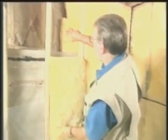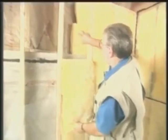Now that we have some of the insulation installed, let me show you what's taking place. First of all, the vapor seal that we originally put on the concrete has gone back down in behind the stud wall and wrapped around and come back up over the insulation that we've installed in between the studs. Now in behind, what we've done, we've laid batts on their side on top of the concrete wall up against the wood structured pony wall. And as you can see, the old insulation that was there already, we have sliced the vapor seal because that way when the vapor seal comes back up over top of the finished inside wall, we don't want to have two vapor barriers, only one.